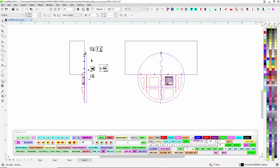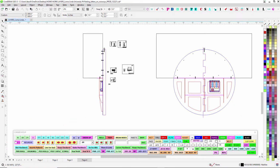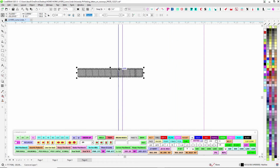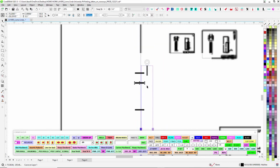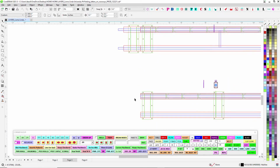That brings us to the mounting methods. And then this brings us to the logos here. So I'm seeing that we would be using these 4-inch studs. I think YJ's talked about how they usually ask us to do a 2.5-inch embed into concrete and then use Hilti. So if that's correct, this is a 4-inch bolt. And so that would be typical for both the letter raceways here.